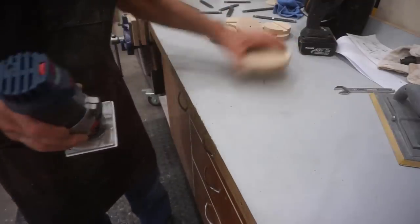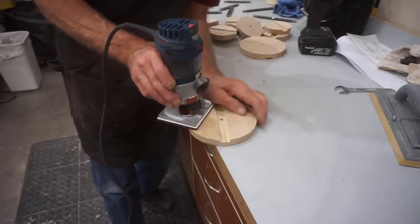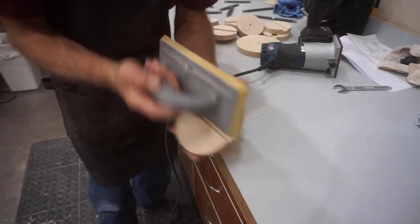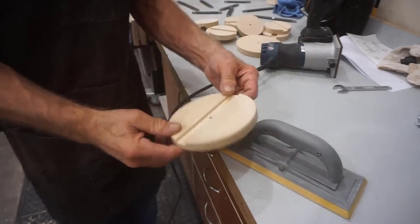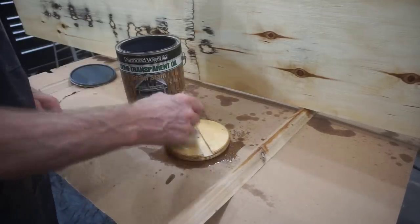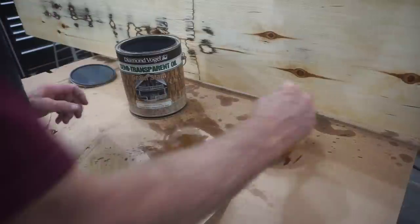With that bit of messy metal fab out of the way, I go back to the discs, easing the edges with a quarter inch shank, one-eighth inch roundover bit in the Colt router. This quick step really puts a finishing touch on the QD hanger discs. After routing, I give the discs a once-over with 120 grit sandpaper on a cushioned gator sanding block to prep them for finishing. I slapped a generous coat of Diamond Vogel's Natural Grain Stain on each one to make them look a little better and to keep shop grime from building up on the blonde wood over time.